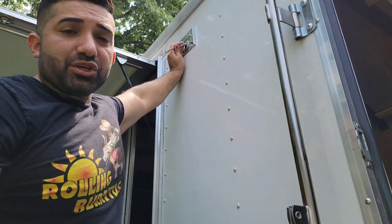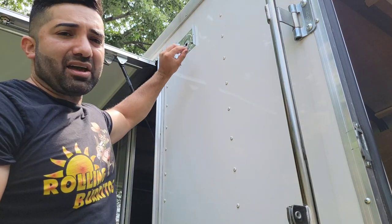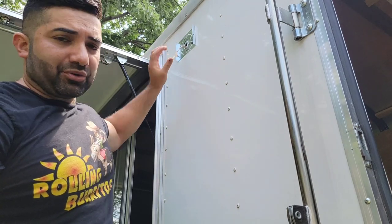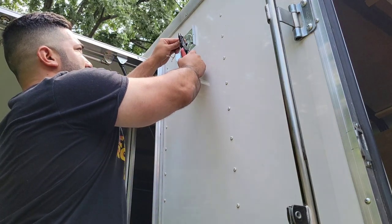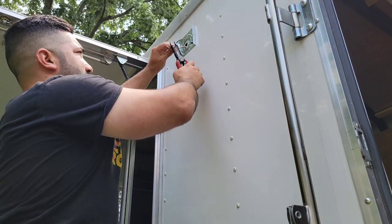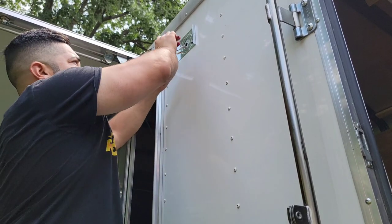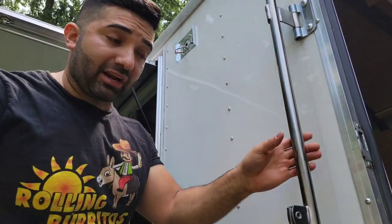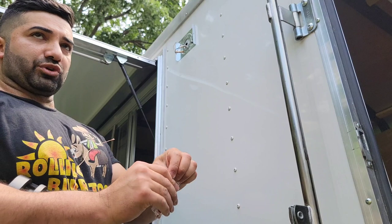So on this one, we used 14-2 wire. 14-2 means that it's just gonna have a hot. On this one, it's being a switch leg and a neutral. And then the ground right here. So we're gonna take our wire strippers right here. We're gonna skin this back. And the copper or the ground, you don't have to because it's already bare. So that's how you have that. We're gonna take our lamp now, which is right here. It comes with wire nuts already included, so you don't have to worry about that.